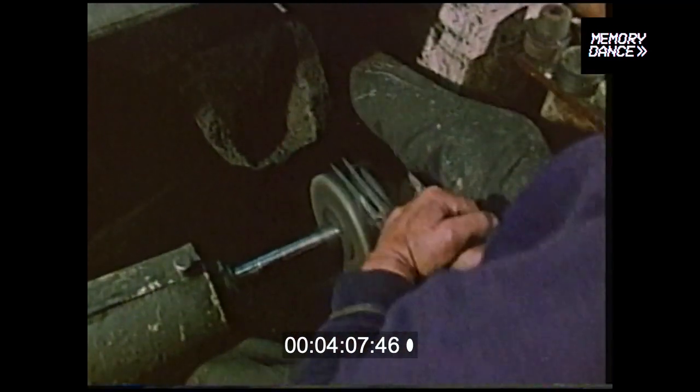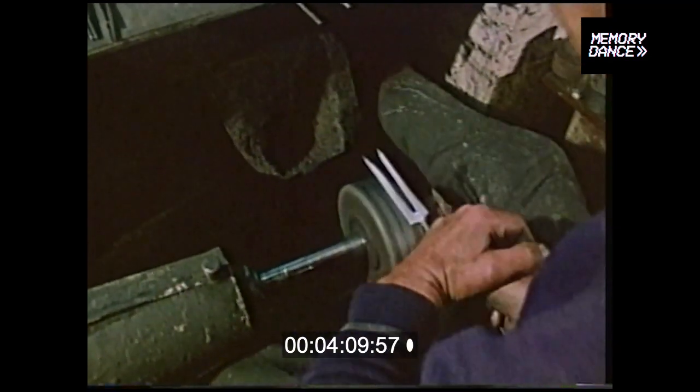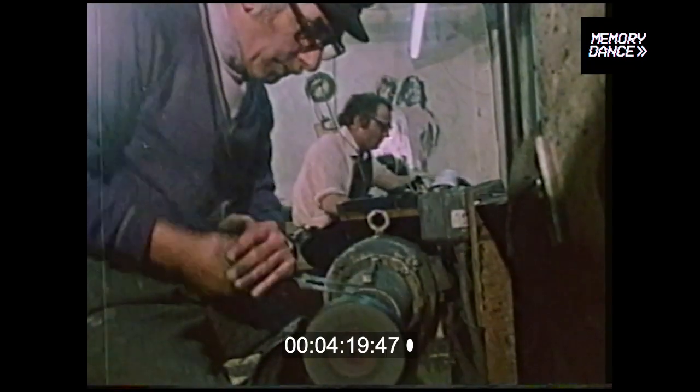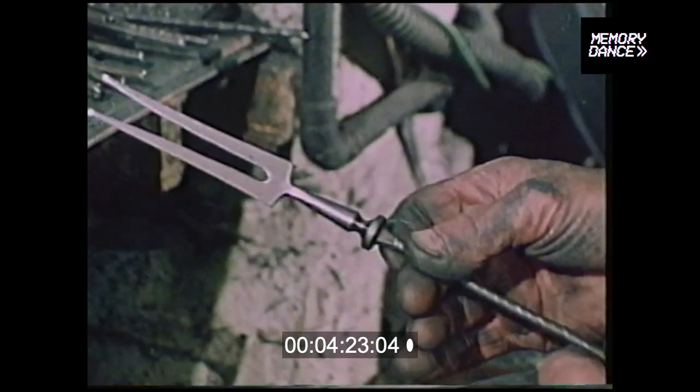After this, we go on to what we call a felt. Now this is a mixture of wool, cotton, and china clay. On this particular tool, there is no emery whatsoever. The only thing that's laid on is a compo, a polishing compo, which consists of beeswax, grease, china clay, and various other polishing compounds. We lay this on, and then follow the same process again by doing the shanks and the prongs. This brings them to a dull bright.